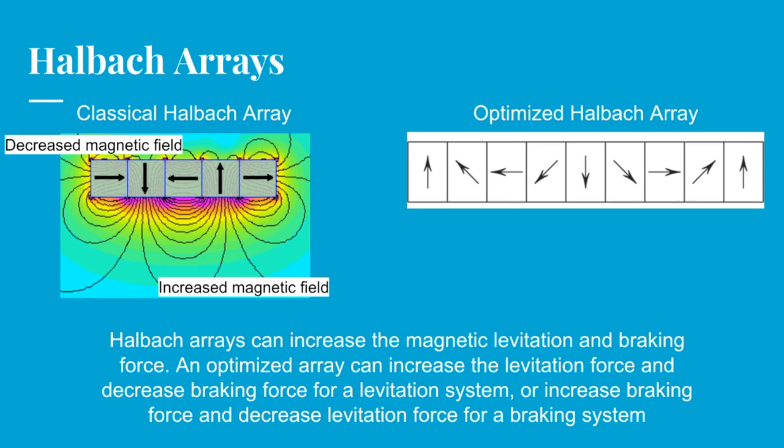So next thing is a Halbach array. Instead of taking one large magnet, you can take some smaller magnets and put them in the orientation shown in this first image. The point here is you increase the magnetic field on one side and make it negligible on the other side. By increasing on the one side, you get a stronger magnetic field interaction, which boosts both your braking and your levitation forces. Here, the arrows are in the direction going from south to north. By putting five magnets in this orientation, you get that array. You can see both the magnetic field lines and the colors, which also represent magnetic field strength. Theoretically, it'll be double — twice as strong — on one side and zero on the other. Realistically, it doesn't quite work out that way, but it still very much boosts that effect. A variation on the Halbach array uses diagonally magnetized magnets for a bit of optimization, and there are many other configurations you can use to get your optimized levitation or braking array.